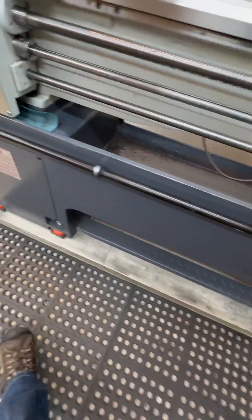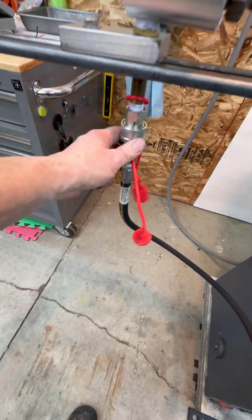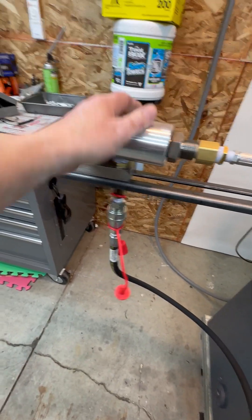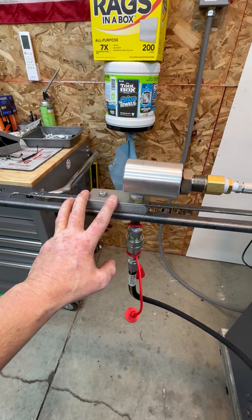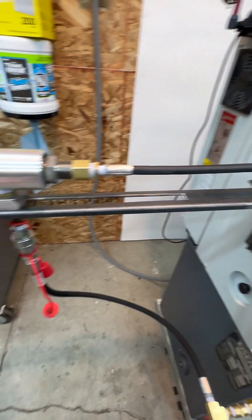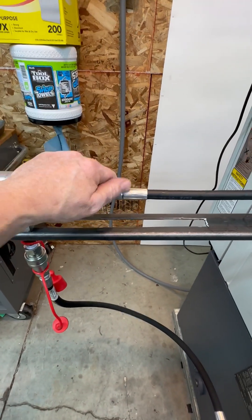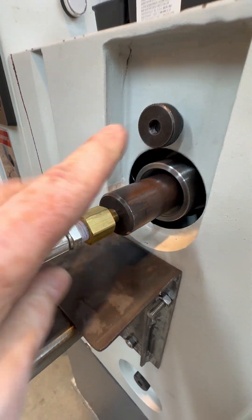From my feed line, to a 90, to a hydraulic hose quick disconnect, to my rotary. This is adjustable depending on the barrel length — thank you Dustin Drews for that idea, very smart. Mine didn't turn out as well as yours, but it'll work. My rotary hydraulic hose, one-eighth tap into the end of the barrel. Using a barrel blank for practicing.